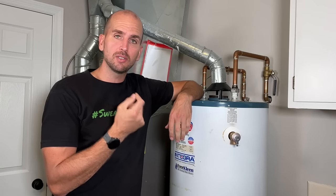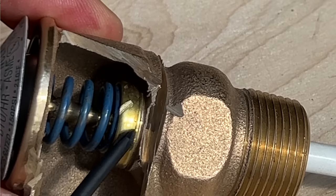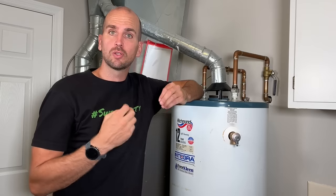If the internal pressure is past 150 psi, that would be enough to force that spring to compress and open up a path for water. If you have a small leak, there is a good chance you might have a little sediment caught right at that seal between the seat and the seal. If we can flush that loose and get the sediment out, that seal can sit against the seat and your leak would stop. Flushing it out is our first step.